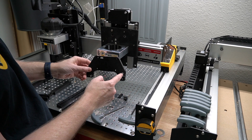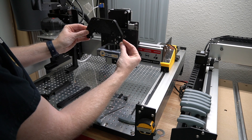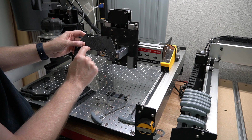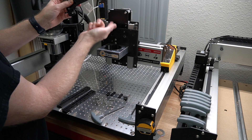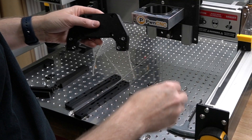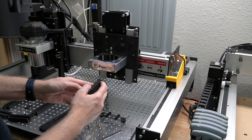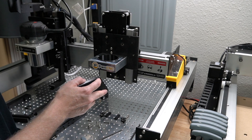We're going to start with this big U-shape piece. This is going to sit right here on the front. This is an early prototype for me, but this little hole right here is actually down here so you can access the screws for your Z homing switch. This is going to mount right on here, and we're going to take these socket head screws — those are going to pass right through the plastic and extend out, going through this metal plate into the standoffs.